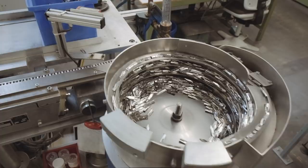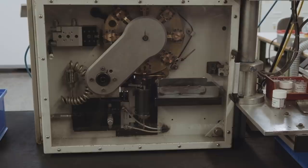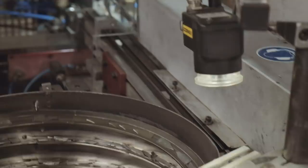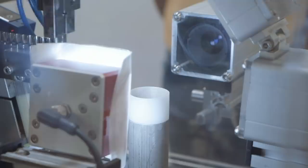Besides the gold nibs, Pelikan also makes steel nibs for their entry-level pens, like the Pura. The production of the stainless steel nibs is similar to the production process of the gold ones. The only difference is that this is done automatically. So also the nibs are cut in the right size, stamped with the logo and bent in the curved shape. After that the nibs get the iridium tip welded on it and the slit is cut. They also have a machine that is checking each and every steel nib's imperfections.